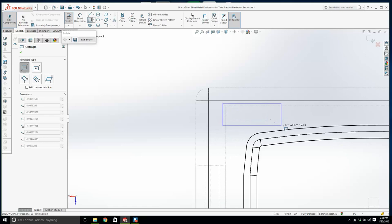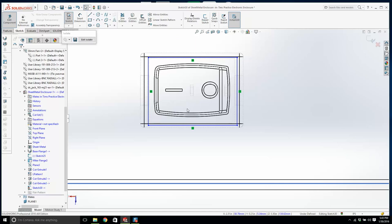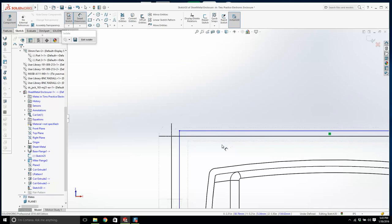Now be careful before you create a relation that you don't want to put in. This dotted line is the housing of the rocker switch. What happens is it gets pressed in and then it clips into place. It has this clip here. Do you see that? There and there, you push it through the panel, and then it locks into place. You've got to give it a little bit of space, though. Okay, telling you too much.